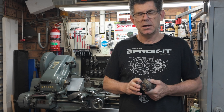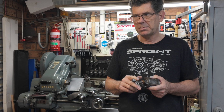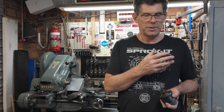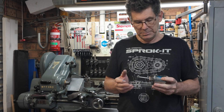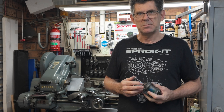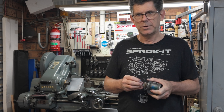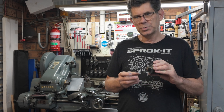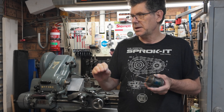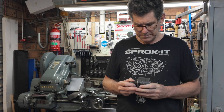So we got there in the end and it came out really well. I have tried mounting the piston on the bed plate, which I don't have available at the moment because I am actually just painting it. But I measured the squareness and the parallelism between this shaft and the bed plate, and it came out basically as good as I could measure. There is a little bit of play in it and that seemed to be in the middle of where it needed to be for it to be parallel. And what is really satisfying is that the distance between this shaft and the base of the bed plate is exactly where it is supposed to be — three quarters of an inch or something like that.